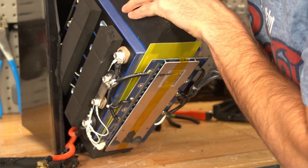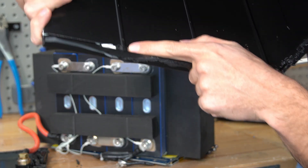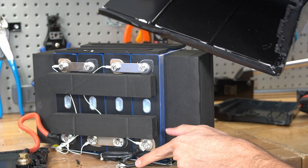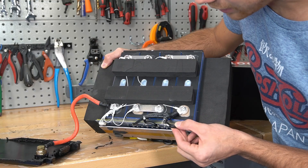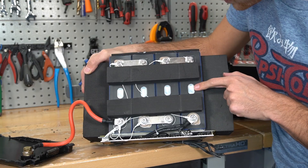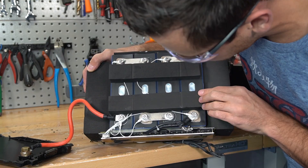Check out this cable — it was smashed into the little spot where the screw goes. I didn't know there were screws to open this up, and that must have happened during assembly. That's pretty dangerous — you have an exposed conductor inside of a battery case near the battery terminals, with nothing besides foam protecting them. The cells, however, look brand new and the build quality on the cells is actually pretty good.